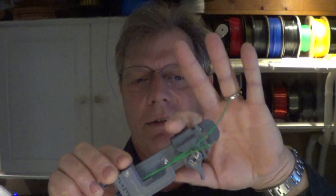And the last thing that I wanted to improve upon was, obviously, this device is under a decent amount of spring tension, and it's pressing down on what is a pretty stiff filament. So as it goes down, the new filament comes down and presses it through. Well, one of the things I couldn't handle was soft filament, TPU. Let me just load this up. Sorry, with it not being mounted on a printer, it's a two-handed operation to do it. Okay, so I've loaded up this TPU filament. Well, what's going to happen? It just bows out to the side. There's not enough stiffness to the filament to make it hold its shape. So I wanted to make a way to make that go away, and so I've done that.